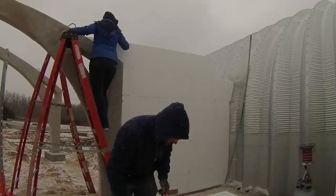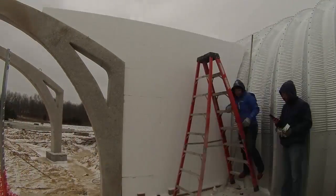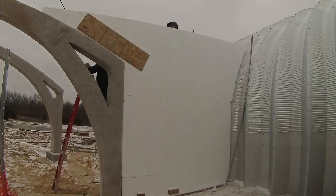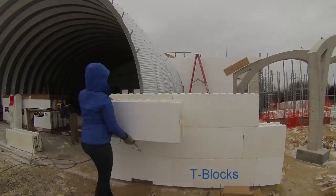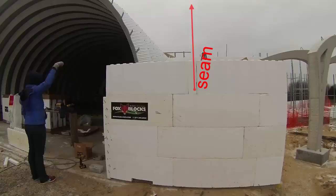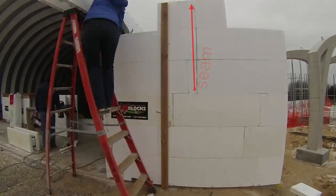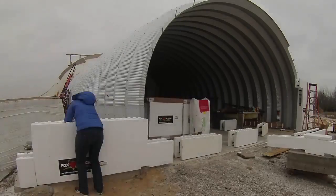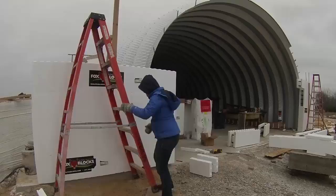The blocks are also easily trimmed with a jigsaw, but you've got to get a longer blade to go all the way through to that HDPE plastic reinforcement. Here again on the south side, the T-blocks cause a misalignment of the higher regular blocks. Fox Blocks training says to just align the seam and patch it with a board — running bond isn't really necessary because the concrete in the wall is still going to be continuous even if the blocks have a straight seam. The patch is just the easiest way to sort it out. The wind was picking up on this side and kept trying to blow over this section of the wall, so we secured it on the back side.